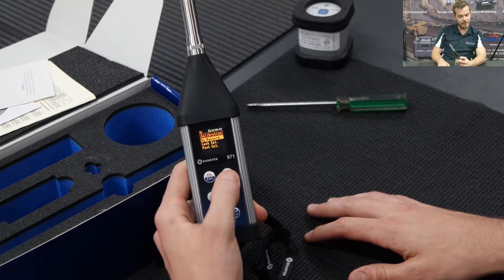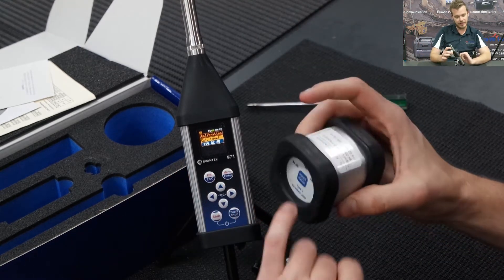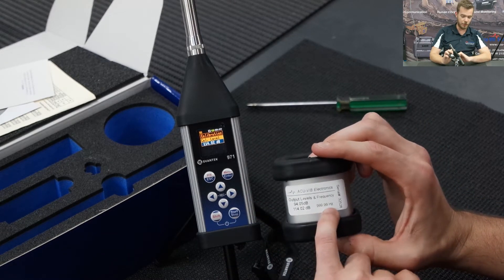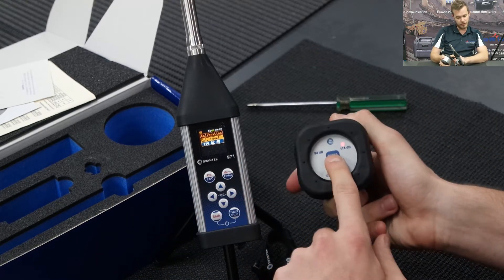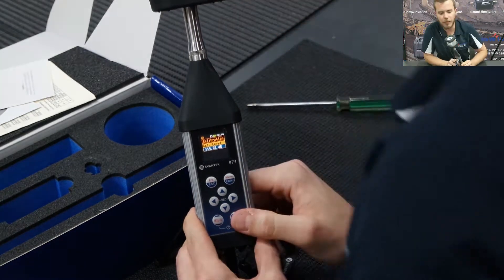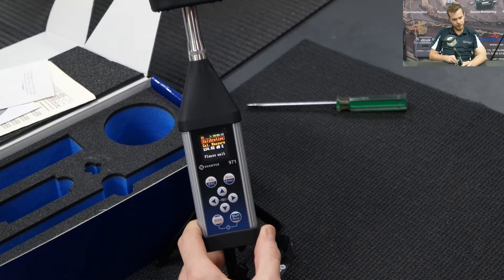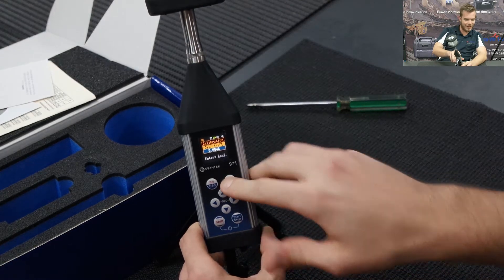Next is calibration — enter by measurement. On the output of our acoustic calibrator, when calibrated, we should have a level of 114.02 dB output at 1000 Hz. So set it to 114.02, put the calibrator on the microphone, select 114, and press start. The instrument will go through its internal calibration. Cal drift shows 0.0 — fantastic. Press enter to save.